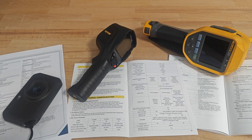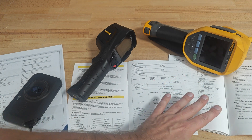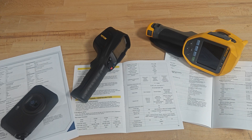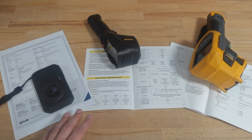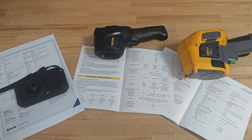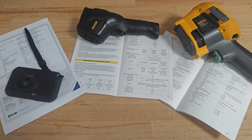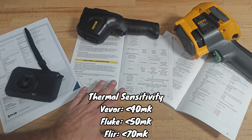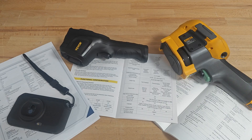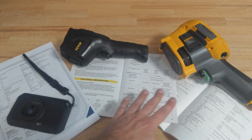We know who's the clear winner on temperature range. The field of view is widest on FLIR, followed by Wevor, and narrowest on Fluke when using its standard infrared lens. All three devices are certified to withstand a drop from 2 meters and all three have an enclosure rating of IP54. FLIR and Wevor use a focus-free mechanism while Fluke features laser sharp autofocus and manual focus. The minimum focus distance is 10 cm on FLIR and Wevor versus 15 cm on Fluke. Thermal sensitivity is highest on Wevor at less than 40mK, followed by Fluke at less than 50mK, and less than 70mK for FLIR. The lightest is FLIR, followed by Wevor, and the heaviest is Fluke.